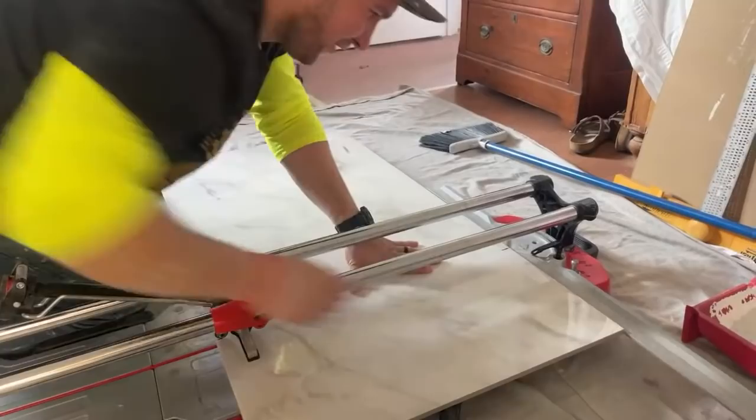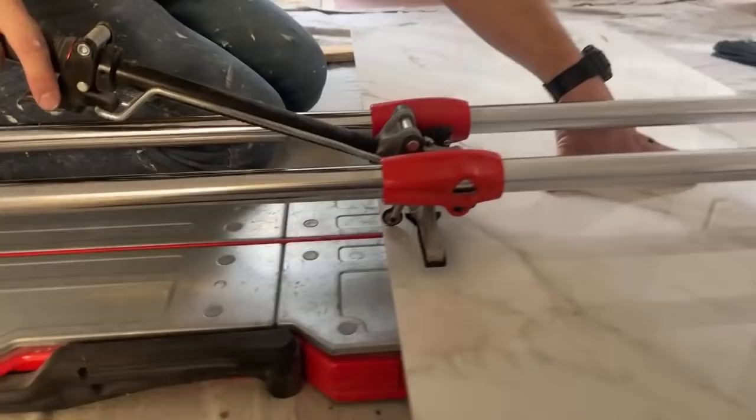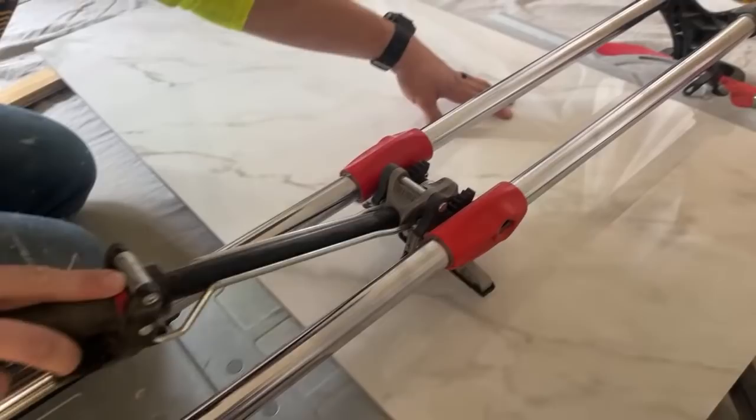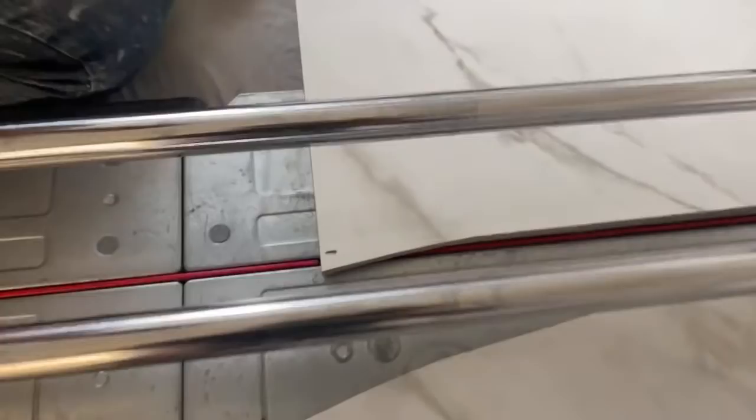All right, hold on. Lined up pretty good here. So here's what you do. First, you get your wheel on there, and then come backwards to make sure that you have good scratch at the end here. And then right over the beginning of it again, nice pressure down, and then right through there. What's cool is it kind of clicks up to there, and then you just give it a nice little bang. And I didn't scratch it enough over here. God dang it.